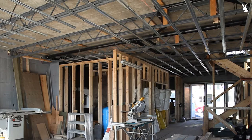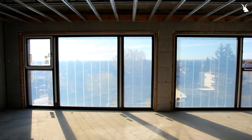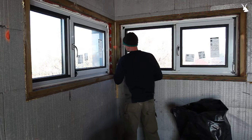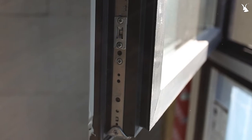The windows are an Inotec product. They're PVC, so they don't transfer heat very well, which is a good thing — you don't want to lose heat from inside to outside. They're all triple-pane, European design, and built in Abbotsford, BC, so we're not going outside of the country to purchase them. They're incredibly secure — they have a pin locking system. On most windows you just have a latch, but on these ones you have pins on all four sides of the window, making it super hard to break the locking mechanism.